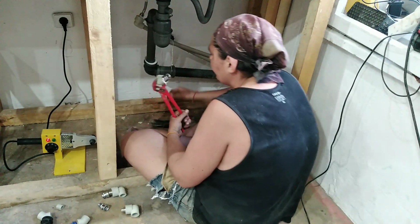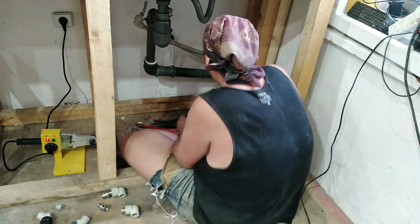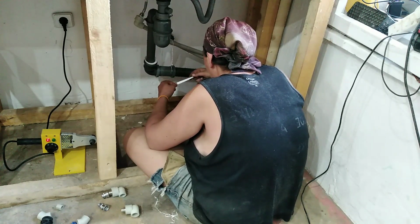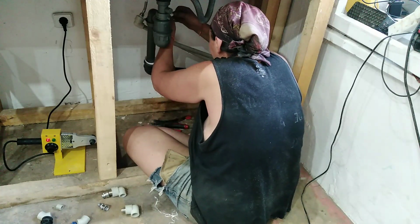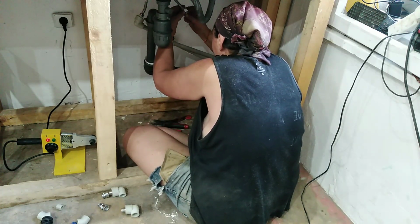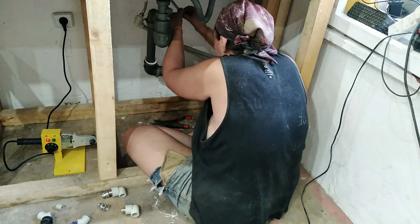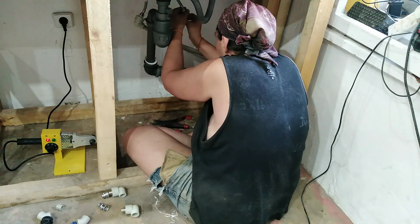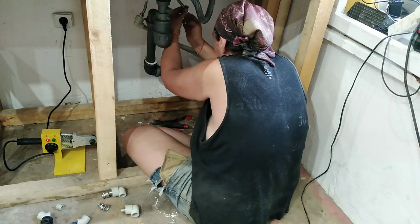Right, I shouldn't over tighten because you're not supposed to do that, so I'm just going to lightly tighten, and I'm going to have to double up the last of my PTFE because that's all I've got left. And I double it up slightly, and you're supposed to take the PTFE in the direction that you are screwing, which now I've clearly lost any sense of any direction whatsoever. So we're just going to put this on here, hope for the best, find out what goes on.